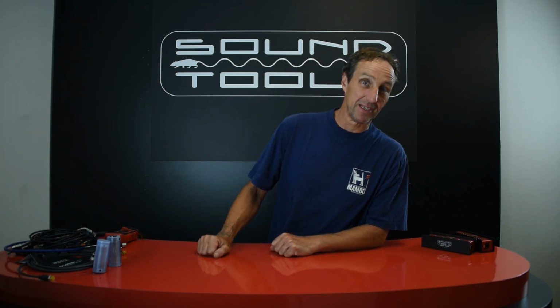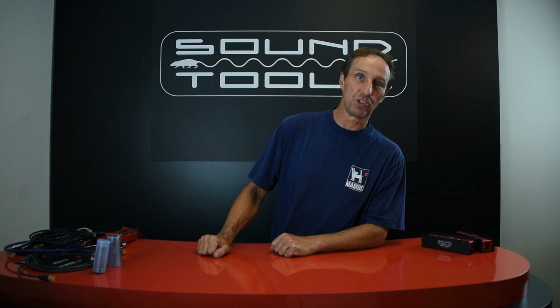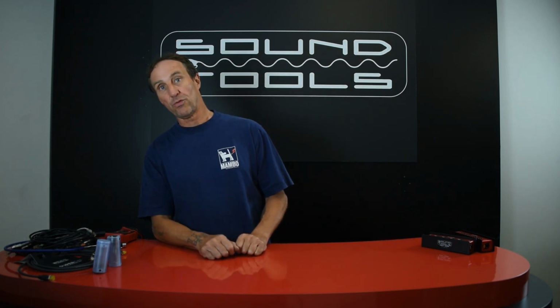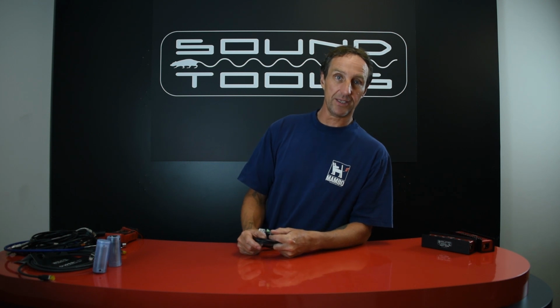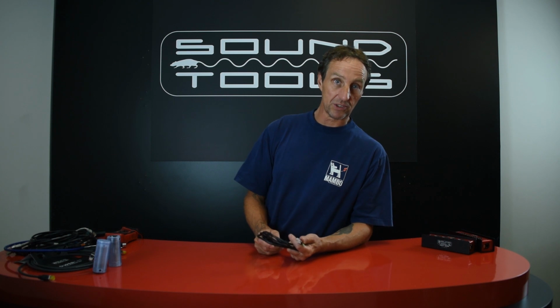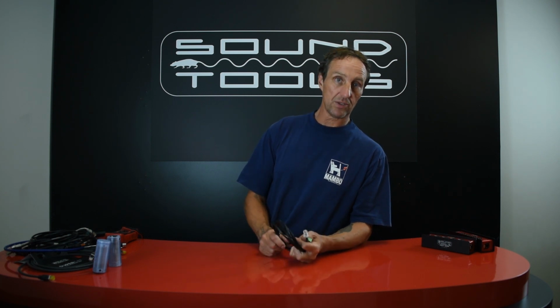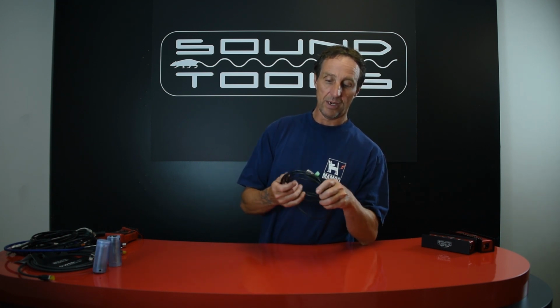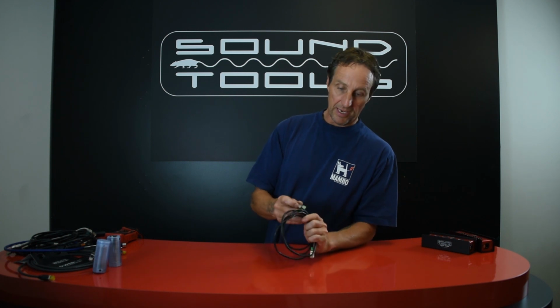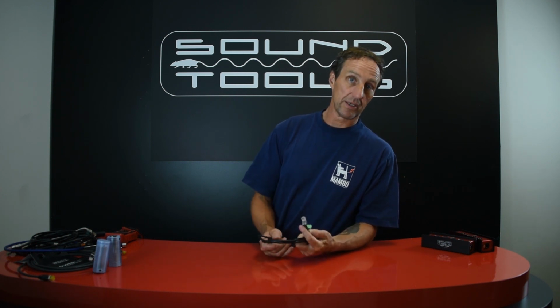Okay, so I'm here to talk about some shielded versus non-shielded etherCON or RJ45 cable. We've been getting a bunch of calls from people hooking up SoundTools CAT box, CAT tails, CAT rack, and WallCAT. The whole basis of the system is to use the 8 wires for twisted pairs inside a standard RJ45 or Cat5e type cable, and the system does rely on a shielded cable.